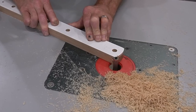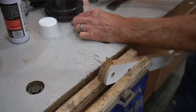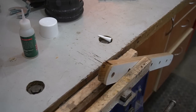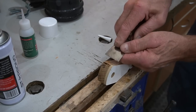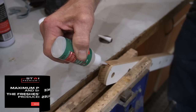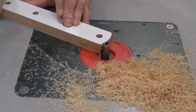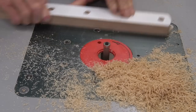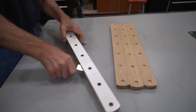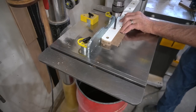I'm probably not the only one who gets wood splinters during flush trim routing. With the help of Starbond glue and accelerator, splinters like this are virtually a non-issue. I apply flexible medium-thick CA to the splinters, push them into place with a putty knife, spritz the repair with Starbond accelerator, and press everything in place so after a few seconds the splinters are glued back. Viewers of Next Level Carpentry can always get a 15% discount on anything on the Starbond website using the special offer code in the video's description. After a minute the CA is hard enough to re-trim the piece with the flush trim router bit.